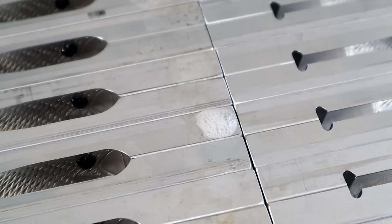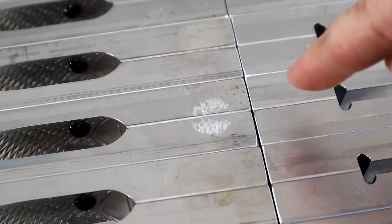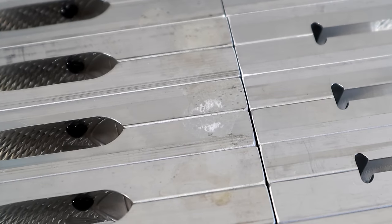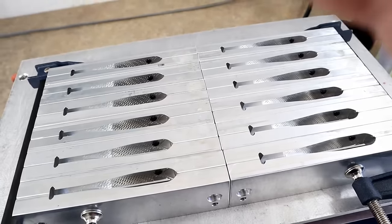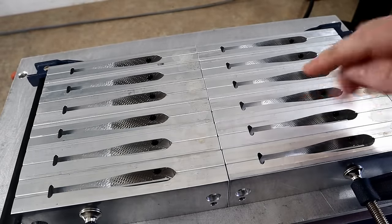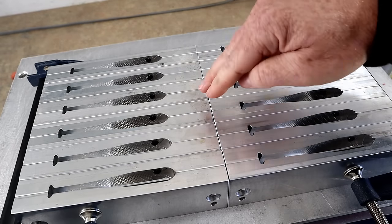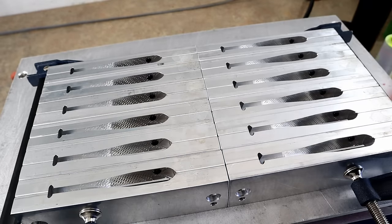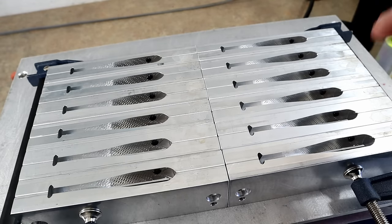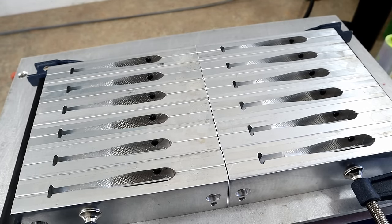Adding a drop of black will successfully pop that effect. New spit test — getting closer, it's bubbling a little but not quite boiling. There it is right there. If you are not seeing that happen, you are not ready for your pour. Back in the day I'd start the belly a little colder, but now I start the pour at full pouring temperature and end at full pouring temperature.